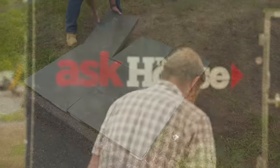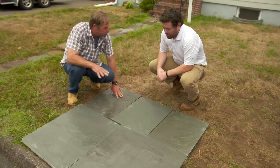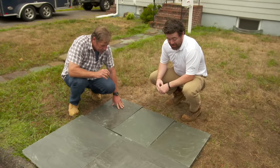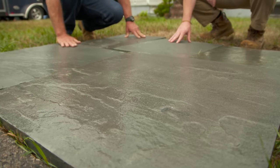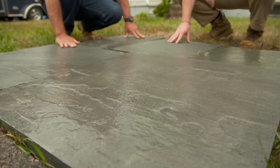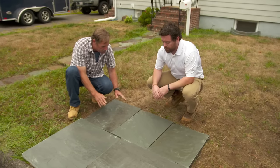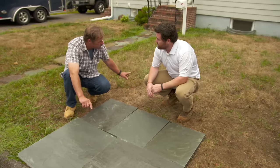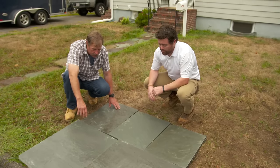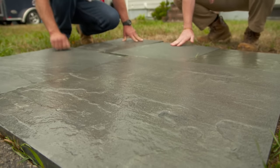Let me show you what we can make a really nice walk out of. This is natural cleft bluestone — this is the way it's split out of the quarry and then it's cut to size. I like using bigger pieces, especially on a front walkway, so they don't move, they don't drift. The walkway is four foot six wide to match up with the staircase, so we're going to have a beautiful walkway coming in. The stone is a little rough so it won't be slippery.